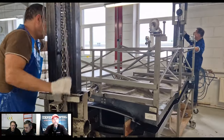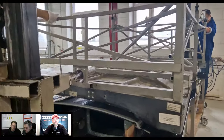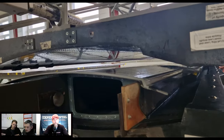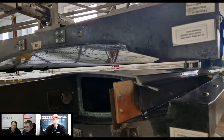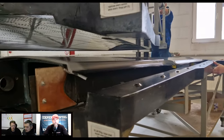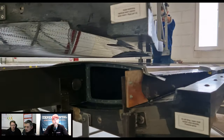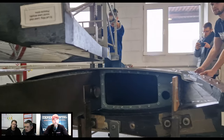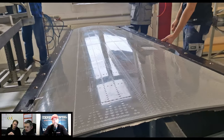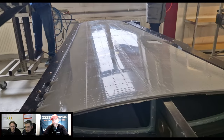Yeah, absolutely. The big structures all together, we have our own curing and temper chambers, and then all of the big molds on their jigs are moved in there. And there are several probes inside the chamber that monitor the atmospheres at different points. And also there are some test pieces laminated where we can trace the ramp ups and ramp downs.